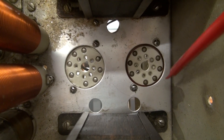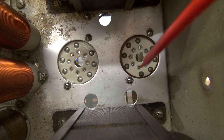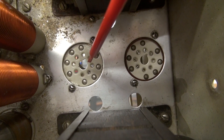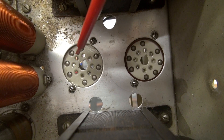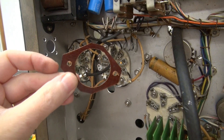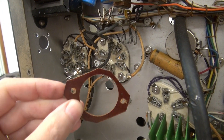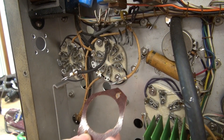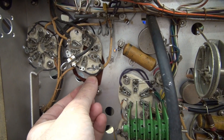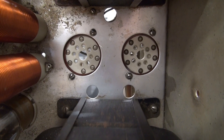If you look at the terminal on the upper right you'll see it's been arcing from that little rivet to the chassis. The socket I just replaced has an insulative gasket around the top side, compared to the one on the left. Those rivets are very close to the edge of the aluminum, so if any contamination gets in there they tend to arc over to chassis. The objective is to put more spacing between the chassis and those rivets. To solve the problem I make these little spacers out of phenolic — you can do the same with a thin sheet of Teflon or nylon. You simply take out the hardware, slide this in between the socket and the chassis. Here are both sockets with the insulators installed — no more worries of arcing pins.